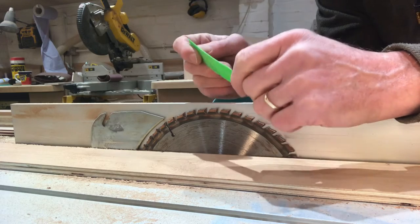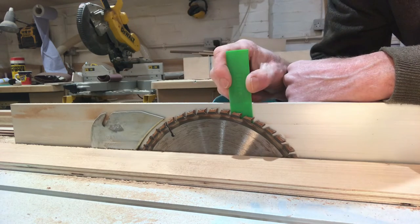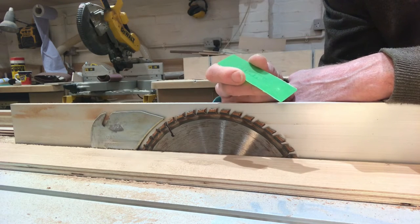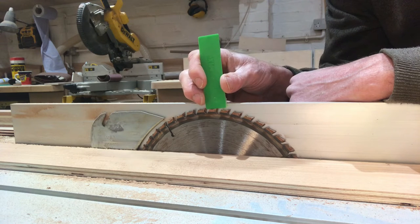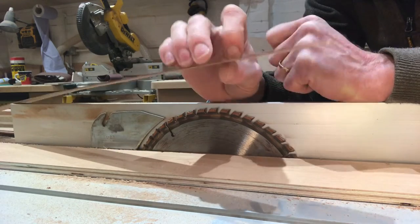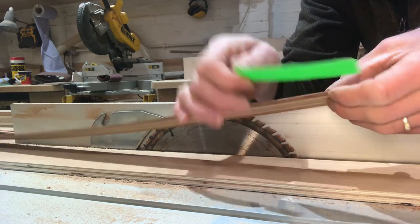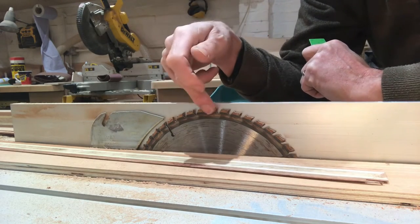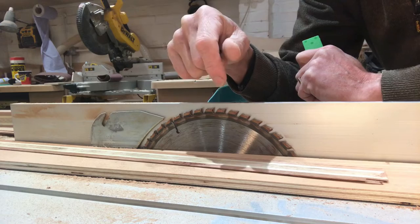To cut down the ribbon strips I'm going to use a one mil packer — that's tight to get between the fence and the blade. I've had to cut them on a bandsaw because the thickness of a circular saw blade is more than one mil, about one and a half to two mil, so you're throwing away more than you're using — more going into sawdust than you're actually using. You do get a much nicer cut on a circular saw bench, but you get an awful lot of waste, which is the problem.